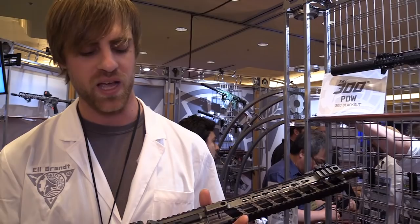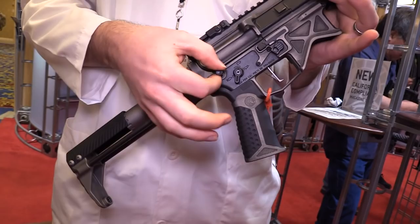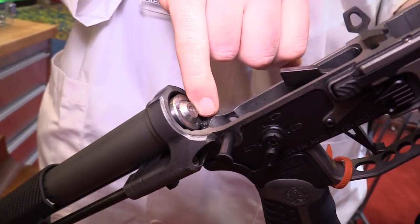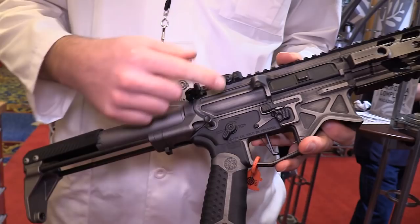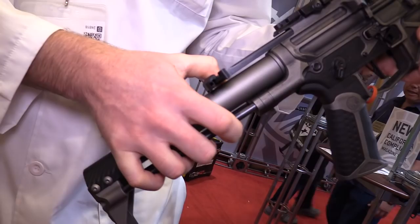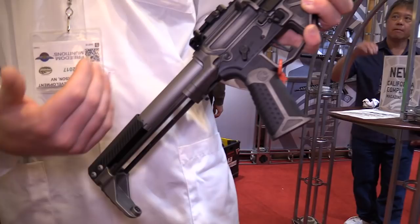Back onto our little buffer system here. We have a very short and compact system. I've still got the rear pin out. I kind of roll my hand right over the top of the buffer tube and slide the system open. Right here is our little buffer — that's our proprietary patented Battle Arms buffer. It protrudes just a little bit farther than normal. What that does is it allows the center pin to actually protrude and align itself on the carrier. As soon as I close this down, it'll depress just a smidge — it'll pop in. Now that buffer is perfectly lined up in the back of the carrier to keep everything dead, true, and smooth. The dual spring system — you'll feel it when you charge the rifle. As it comes to the rear, almost at the bottom, you'll feel the last half an inch where you pick up the dual spring system. Any extra energy as the rifle is cycling, that dual spring system bleeds off all that excess energy, and it actually gives you a lighter-feeling recoiling rifle than standard.